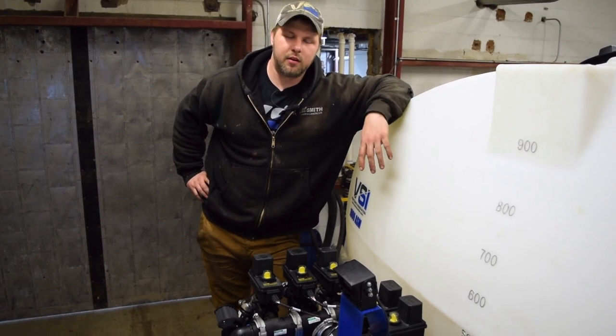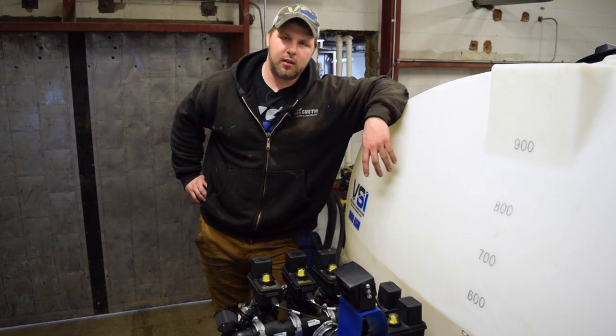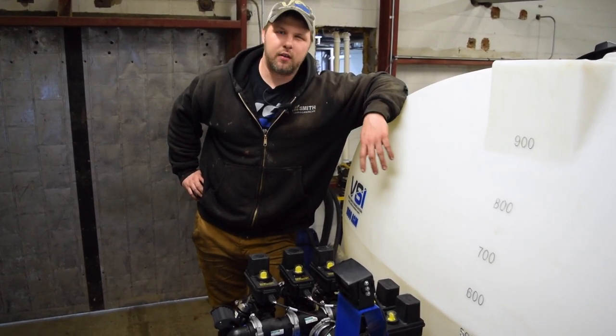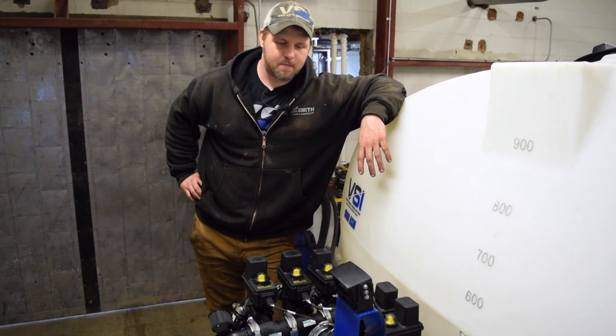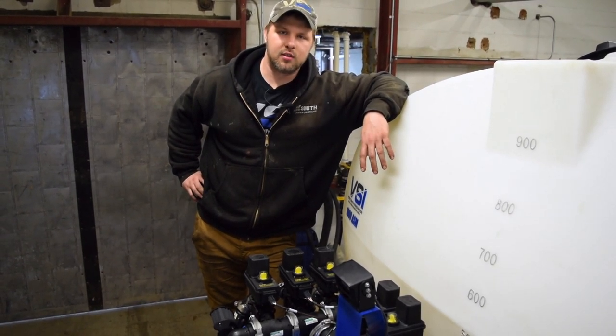One thing to consider, this truck obviously has a hydraulic pump on it, but if you do have the gas pump on your sprayer, now is a really good time to throw in either a stabilizer or some kind of fuel treatment additive. I'm a big fan of the Marine Stable. It's got the ethanol neutralizers in it. Had really good luck with that. Just make sure that you put something in there so that the carb doesn't get plugged when it's sitting over the humid months.